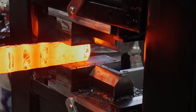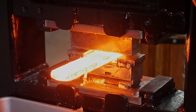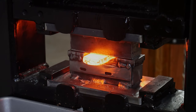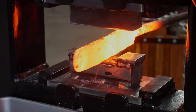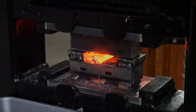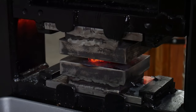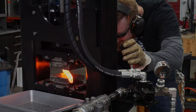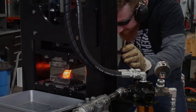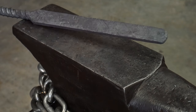I used my aggressive drawing dies to get the bulk of material drawn out and then put my kiss blocks in to make sure everything is a nice consistent thickness. You see me using the kiss blocks for the first time here — I slowed it down just to show that. I drew out the rest of the billet keeping the kiss blocks in to maintain the same thickness in the wider direction. I also put my flattening dies in to make sure everything is straight, putting the billet in diagonally for a larger area of contact.